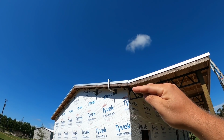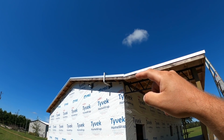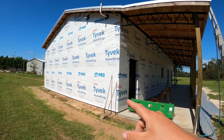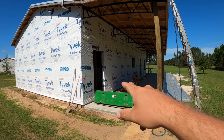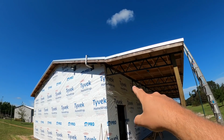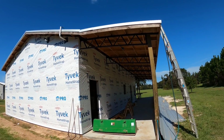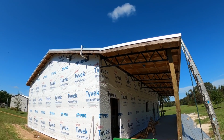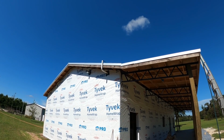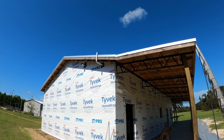And if you see that water level dropping any, now it'll fluctuate some with temperature throughout the day, but if you start seeing it just steadily dropping and vanishing on you, you need to be checking all your fittings because you have got a leak somewhere. I've already had this system halfway filled up for days. I have found no leaks. The level has not dropped, but there's still a lot of fittings upstairs. So once I get that completely filled up, I can start walking the attic, everything else, and check and see if I see any leaks and see if we pass the test. Because obviously if you have a water leak, you have an air leak, which could potentially back up sewer gases into your home, and that's something you don't want.